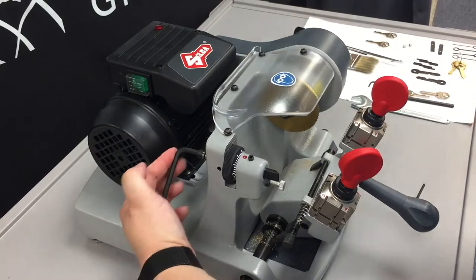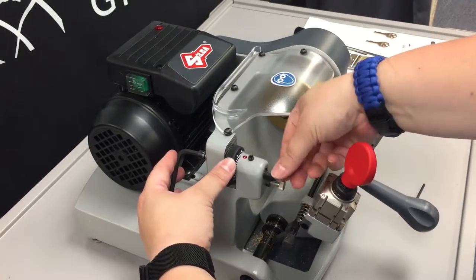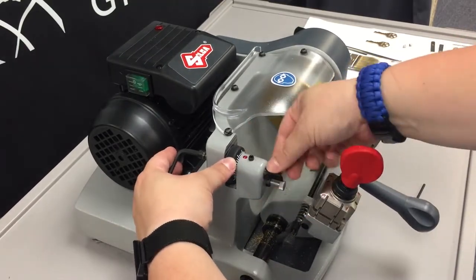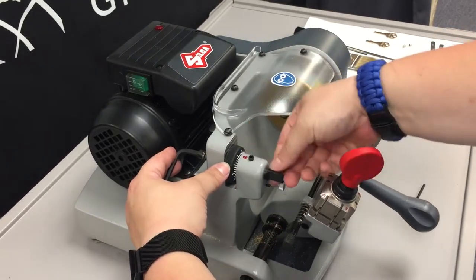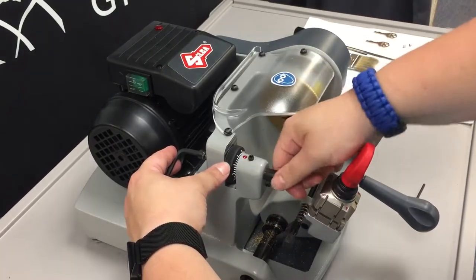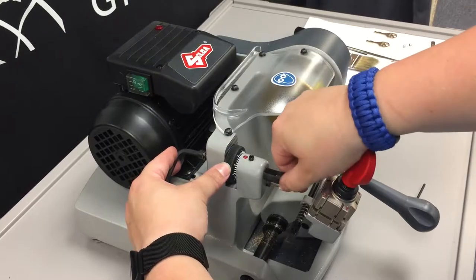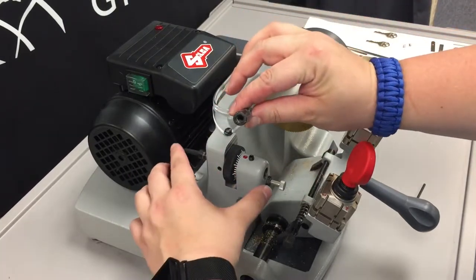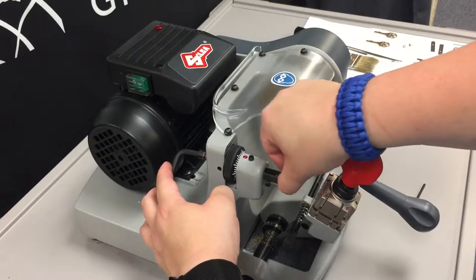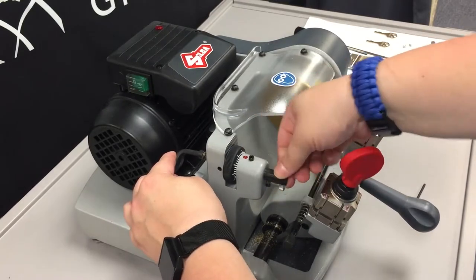We're going to keep using our 5mm Allen key to hold it in place while we simply unscrew the tracer tool. Once that is loose, you can then take it out. You can see the threading in the hollow shaft that actually screws onto that bolt in the back. And then you can use your new tracer tool, put it in, and begin to screw clockwise to lock it back into place.